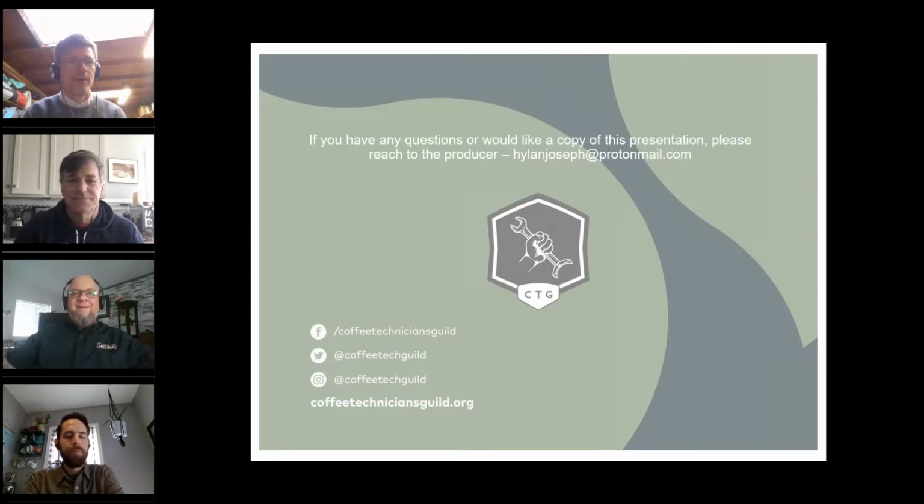Let's start with Arno. Well, if you're working on most roasters out there, the first thing you need to understand is natural gas or propane, for sure. And it's not the same as compressed air. Also, though, many roasters do require compressed air on board. They may have water-based flame suppression systems, right? So there's a couple other things you're going to have to pick up there. But just for safety's sake, if you're working on a gas-fired roaster, make sure you really understand how to check for gas leaks, that you really understand the purpose of a purge cycle, because there is danger there. I'll let other people elaborate. I just want to say safety first. David?